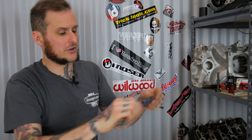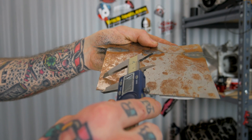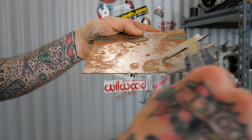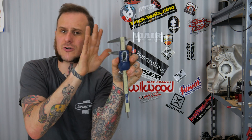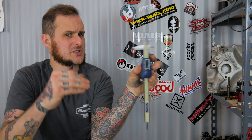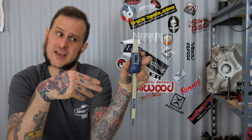There are plenty of uses for these — I've already highlighted a few, and there's one more that I do not endorse but I'll show you anyway. Say I want to scribe a one-inch line on a piece of sheet metal — I'll set these to one inch, use the screw to lock them in, put one side of the jaw against the edge of the material, and use the point of the other jaw to scribe a line. I don't endorse this because even with hardened jaws, you're going to wear them out over time — especially if you spent money on a good set. But if you pick up a cheap metal set, these can help you out with scribing lines as well.